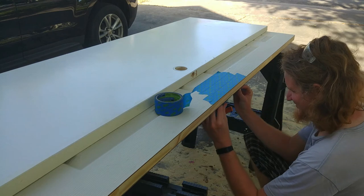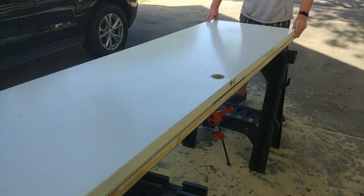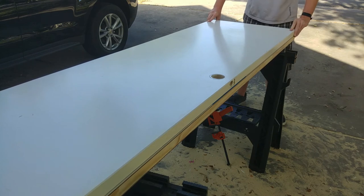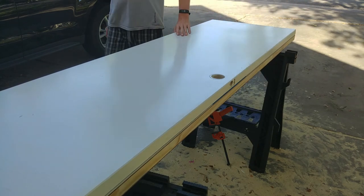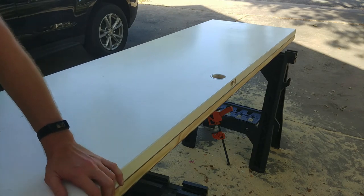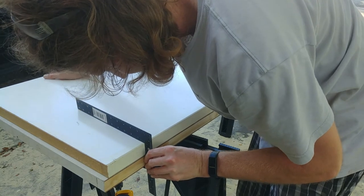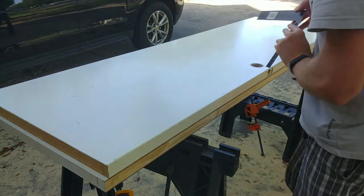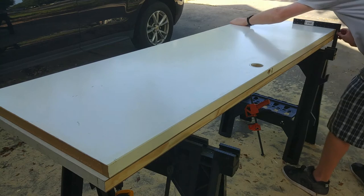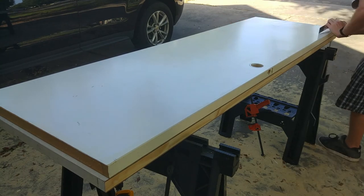Once I had the tape in place, I aligned the old door on top and made sure it was lining up with the top of the door rather than the bottoms, as if I needed to trim any height, I'd rather trim it off the bottom than the top. Plus, the previous doors were cut to fit carpeted rooms, and now we have wood floors, so the extra inch or so of length on the bottom might help out with that.